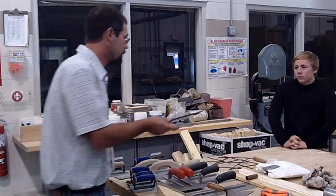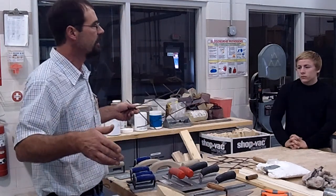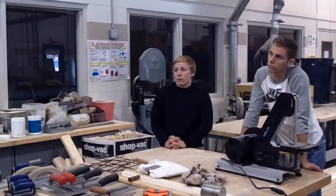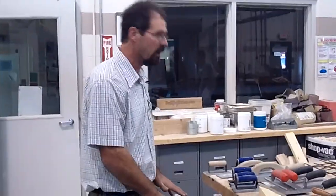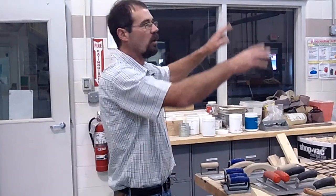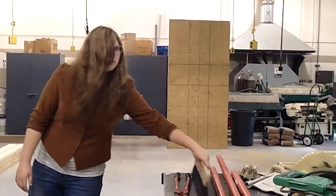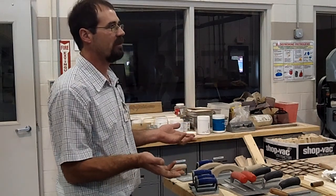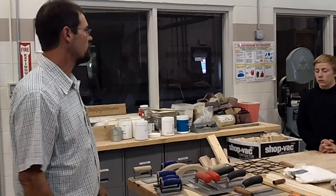Mine always do anyway. Anyway, so we have this, another way you can buy this wire mesh. It's a little bit thinner, but it comes in a roll, and it's 3 foot wide. That stuff's really dangerous because when you roll it out, what do you think that roll is trying to do? Because it's metal, it springs right back where it was, so it's trying to roll up on you. So normally what you do is you have one guy stand on the end of it, and hopefully it doesn't get off it on you. You roll it out, measure what you need, you nip it with those bolt cutters, and then usually to handle it, to move it into where you're going to put it in your concrete, you turn it upside down because then it's not trying to roll up so bad on you. But when you flip it, it's wanting to stab you and scratch you.